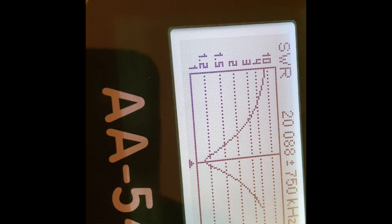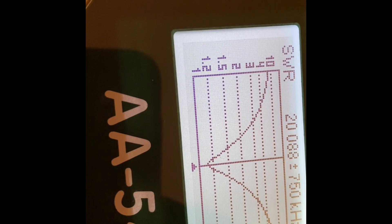It's a really easy thing to do — you just need an analyzer. Make a loop of wire and have the trap inside that loop, squeeze it as tightly as you can without touching the actual trap, and you should be able to see a dip occurring at a certain frequency in your analyzer. Luckily, both dips were below the band itself, which was a good sign.